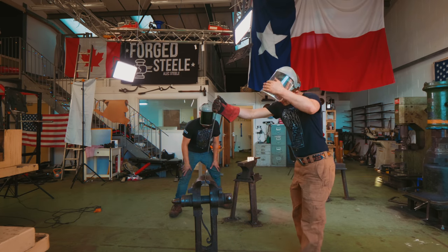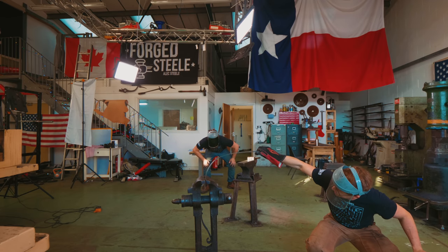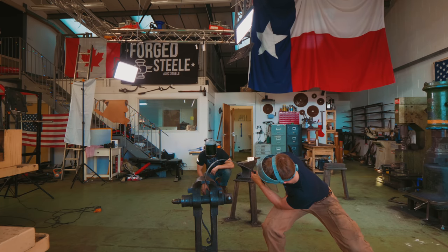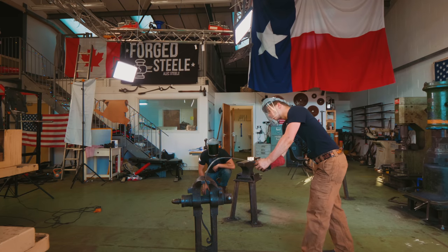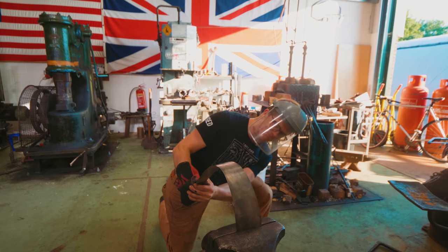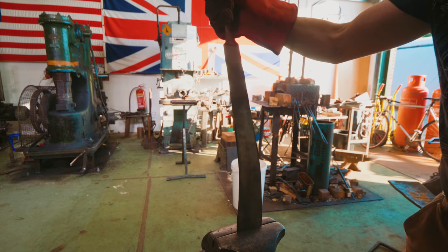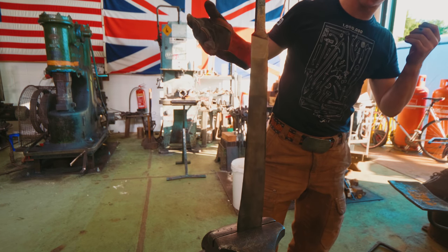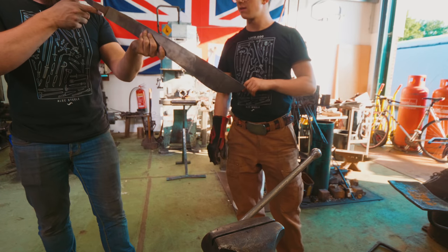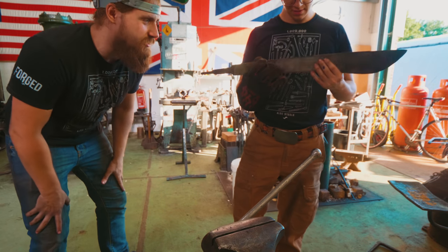And that's 90 degrees. That is the beauty of a hamon — we have soft steel supporting a hard edge. What's really interesting is they curve in different ways. I would call that a decent bit of an angle. And now it quickly goes back to straight. This is what a hamon is supposed to do — the thing they put in a Japanese samurai sword, bending it straight after it bends in combat. This is it.